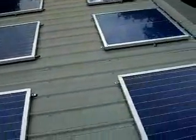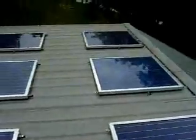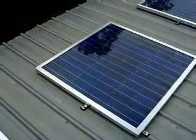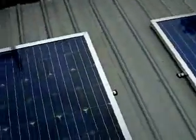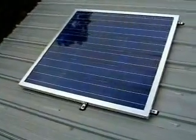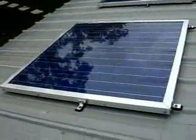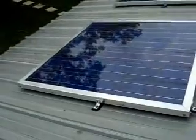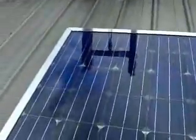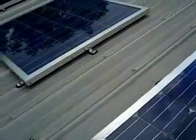I made all these solar panels. They are 41 inch by 41 inch, 12 volt, which if you read them with a multimeter, they put out around 20 volts in full sun at about an average of 7 to 8 amps. A lot of it depends on the cells that you choose.